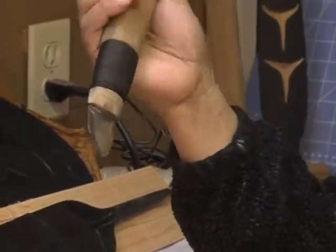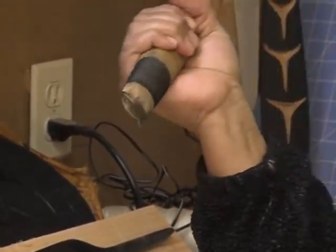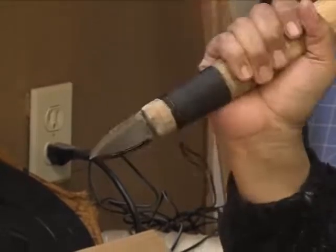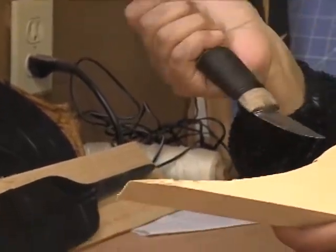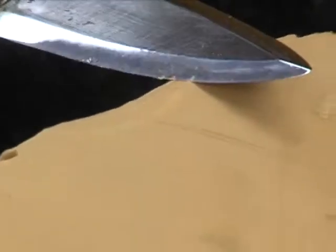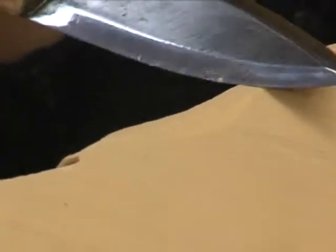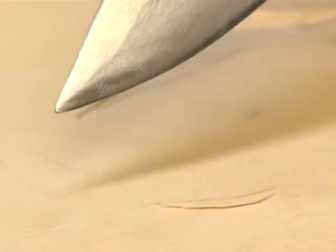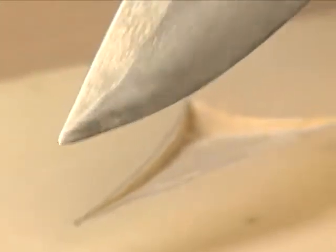You hold the draw knife with a tight grip with your whole hand, and all the motion is in your wrist. I'll show you a little bit — it's just taking the wood away in little chunks so you don't destroy your piece. It's actually really soft to use.